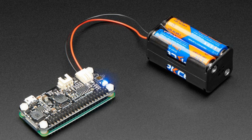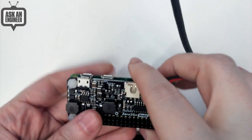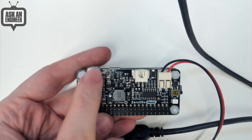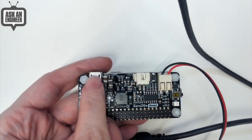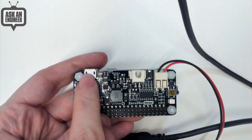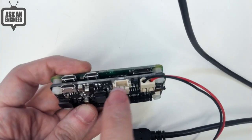If the input voltage is between 3.5 and 5 volts it will boost up to 5V, and if it's above 5 volts it will buck the voltage down. It can do about 2 amps either way, so it's quite a powerful power supply with a really wide input range. One of the inputs is a micro USB — even though it's micro USB shaped it doesn't have to be 5V in; it's intended to connect to a power pack or wall adapter.